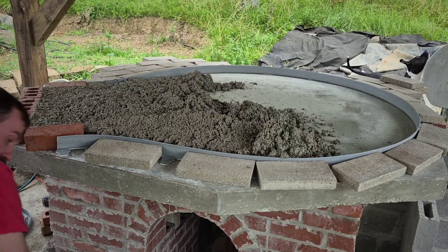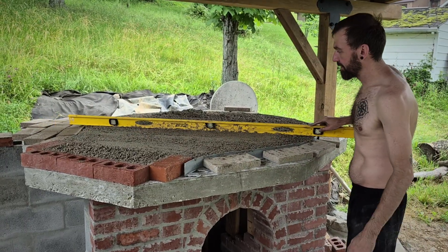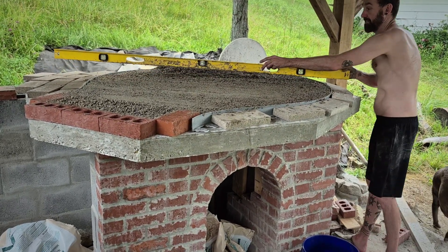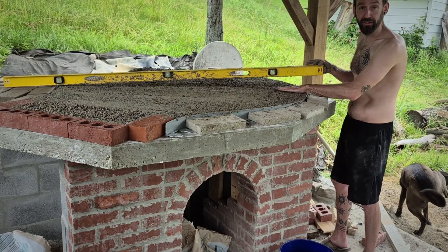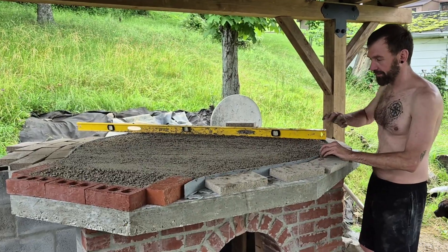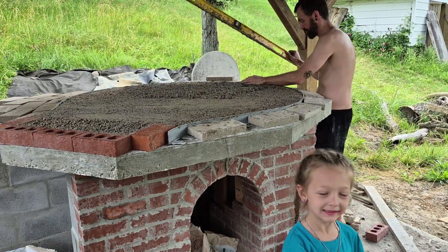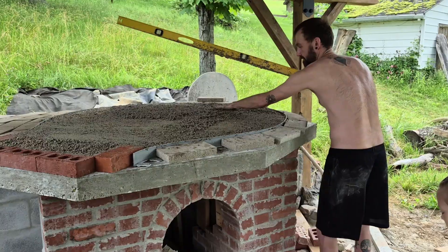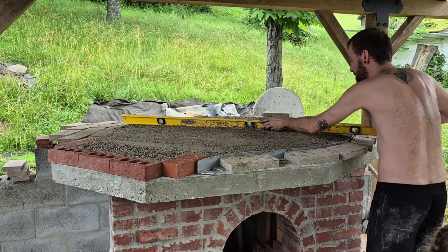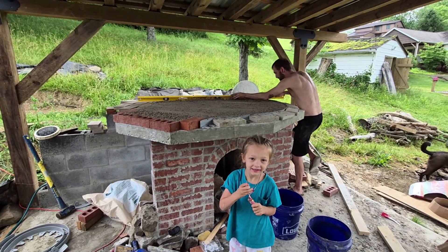Alright, so we've got to mix this one now real quick. So once you get the vermiculite concrete, you're going to screed like you would regular concrete. Keep in mind there's a base layer of fire bricks going over top of this and you're going to use sand to level it. It doesn't have to be perfect — you want it leveled, but if there's little bits or divots or whatever, it's all going to come out. After you get your concrete spread good and as thin as you can over the area, that's all you do — screed like normal. It'll fill itself in in the gaps.